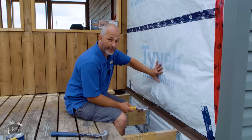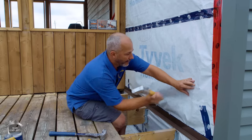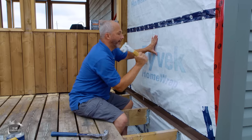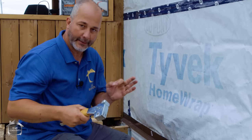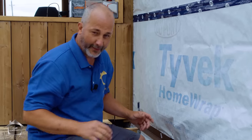Until you've satisfied that requirement, there's no sense investing money renovating because it's all going to get eaten by the bugs anyway. And like most home renovators, we just use staples to attach our house wrap — and it works better if there's some in the gun. Now if you're going to leave this unattended for any length of time, make sure you use the nails — there is a plastic cap nail designed specifically for house wrap. If you're new to renovation and not familiar with all your fasteners, click the link up here; we did a video explaining a lot of the basic fasteners you're going to be using.